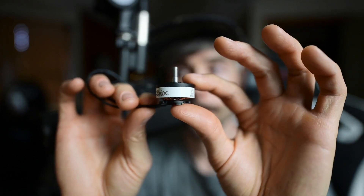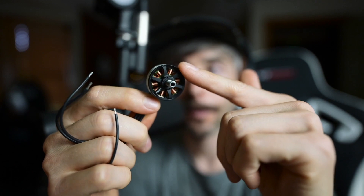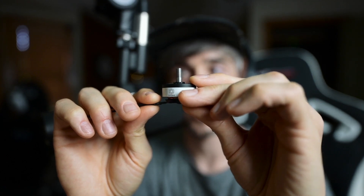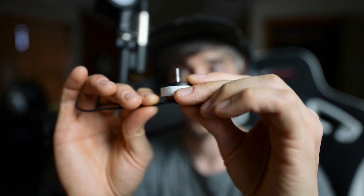The V3 KVs varied: 2345 KV and 1750 KV. The black top with white side is the 1750 KV — I call them the Stouts, which is my 6S version. Then there's the Silk, which is solid white and the 4S version at 2345 KV — same 2306 stator, different KV. That motor came out in 2019, has been very popular since day one, and still sells today. I still use them on multiple quads.